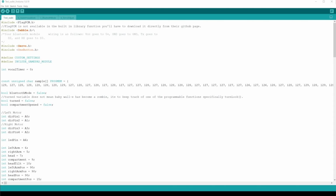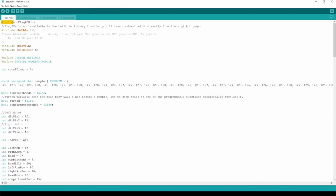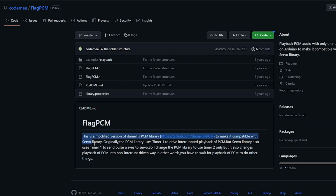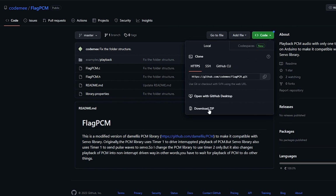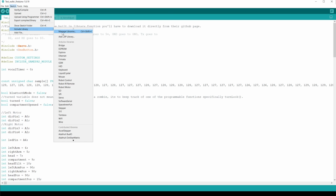Upload. To get access to the code, click the GitHub link below, which will take you to this page. From there, you'll be able to directly download it. One thing to note is this Flag PCM library. It's not accessible through the built-in library manager, so you'll have to go through the GitHub page and download it separately. This just allows us to use the speakers without interfering with the servos. All other libraries are available under the Manage Libraries tab.